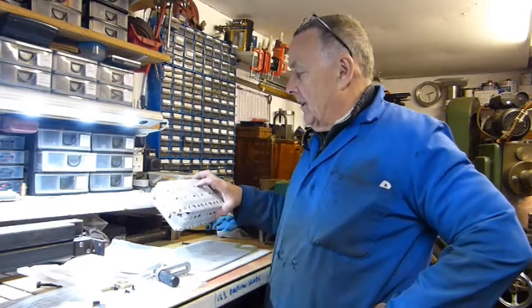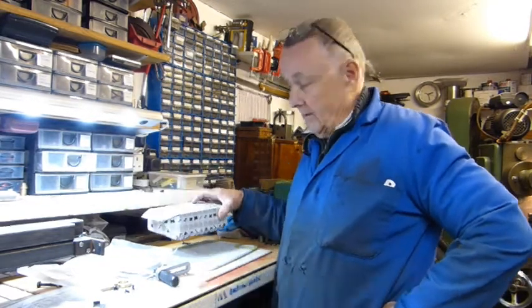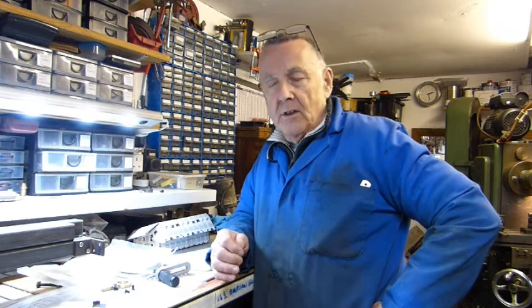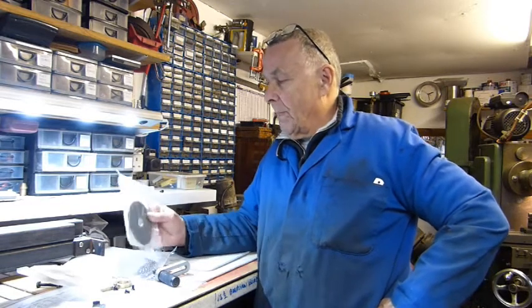Now that it's all done, I'll invest in one of these indexing plate sets from IDG, which converts your rotary table into a dividing head. I already have a dividing head — a quite good one, a Victoria dividing head — and it's served me well. The only trouble is it's very heavy, a bit too heavy for the size of my miller, which is only a Tom Senior miller. Moving the dividing head up and down is the problem.